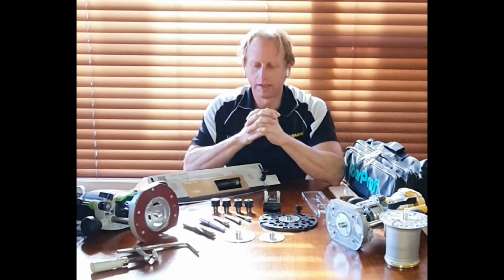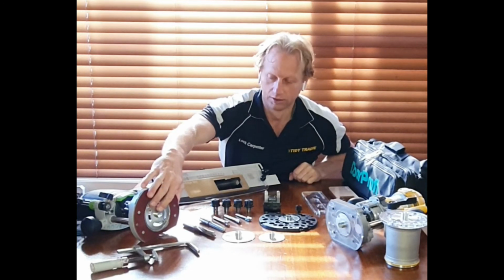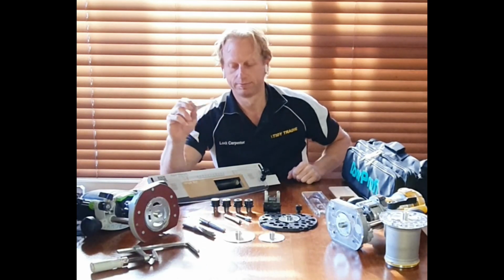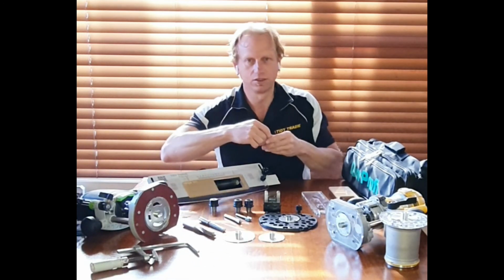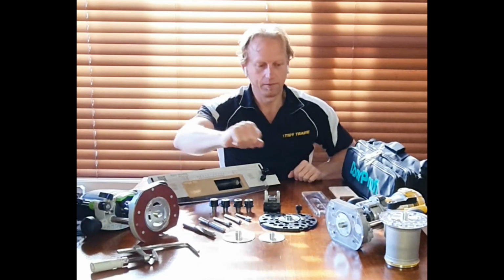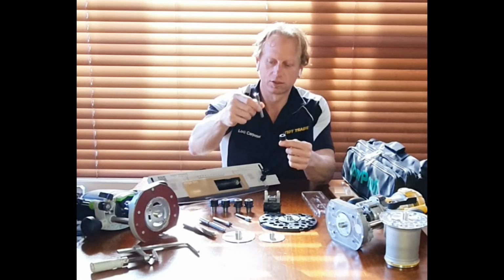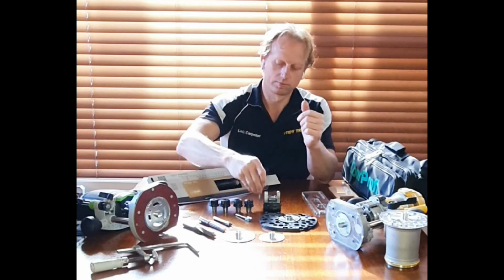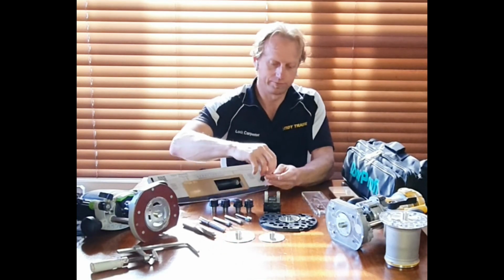So then let's talk about cutters. With the Festool model, and because we're using 17mm copy rings, we have imported 13mm cutters with an 8mm shank. So it just means using one of those on there to do your butt hinges, your shallow cuts like face plates, things like that. With this model you can still use it, and the Makita as well, but you'd use a 12mm. So this is a 12, that's a 13. We'll be supplying both, and that's a long reach with a plunge cutter. So these are ideal for working with this type of template and doing what we want to do.